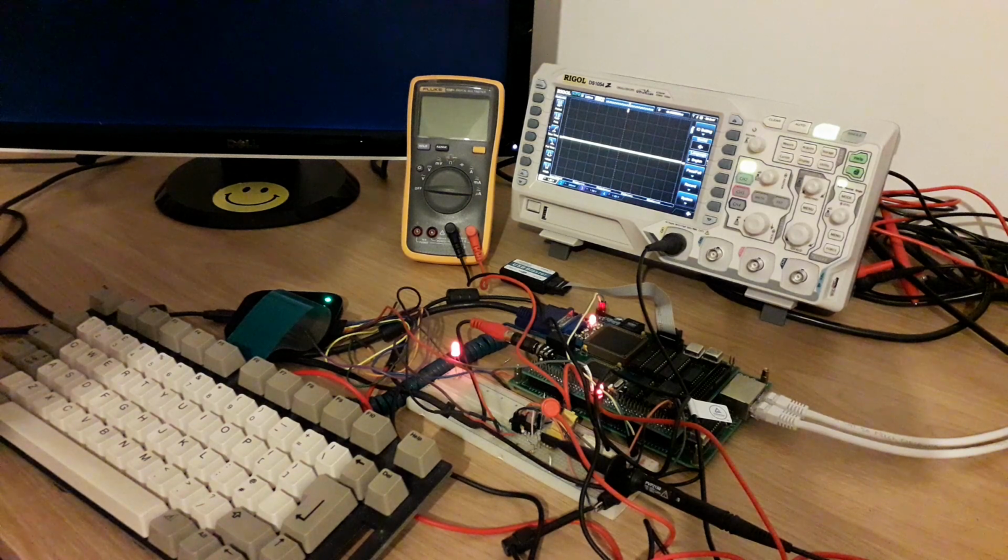So basically I've implemented my own VGA controller inside this EPF10K10 FPGA. It's written in VHDL. One of the interesting things about it is the console mode uses the RAM bits in the FPGA to hold the pixel data for the fonts. There's just enough. You get 3 lots of 256 bytes, which is all of the printable ASCII set, assuming you're using 8-bit wide by 8-bit tall characters.